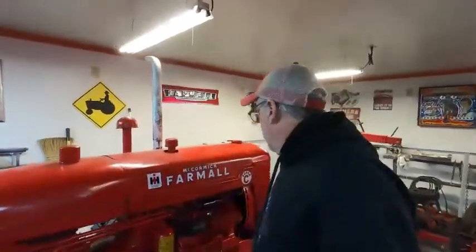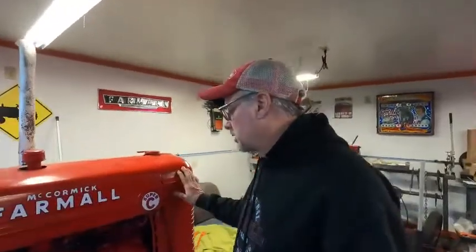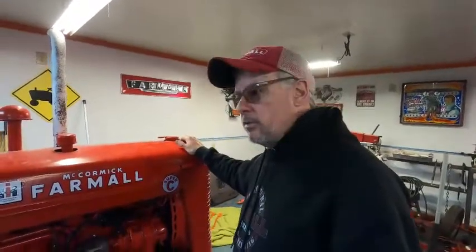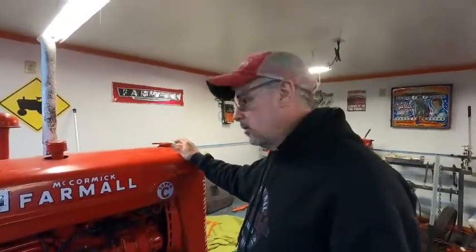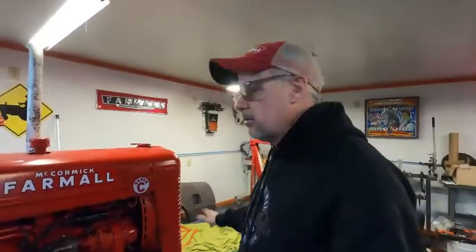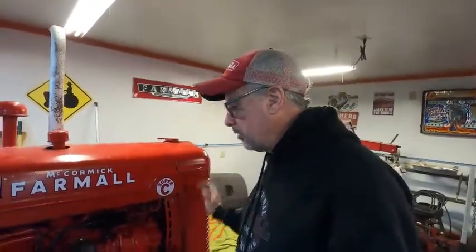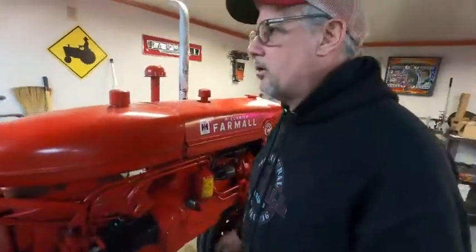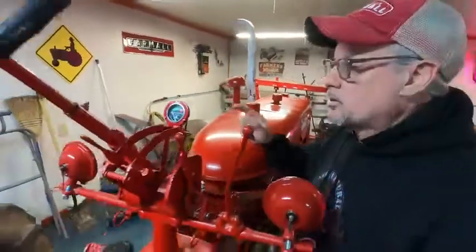All right, welcome back. It's the end of the day, the end of the video. I'd like to thank everybody for hanging out till the end of the video. From the previous pictures, you could see that the upper and lower hoses were changed. I did flush everything out, so the water was nice and clear. So we're good there. Antifreeze is topped off. Oil change is complete. Got the new oil pressure gauge installed. Got the new touch control temperature gauge installed.